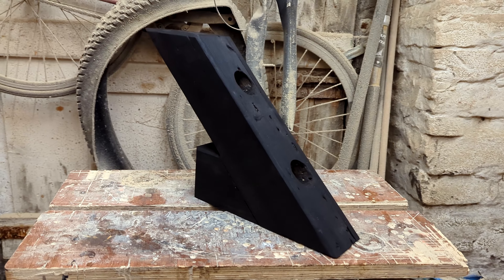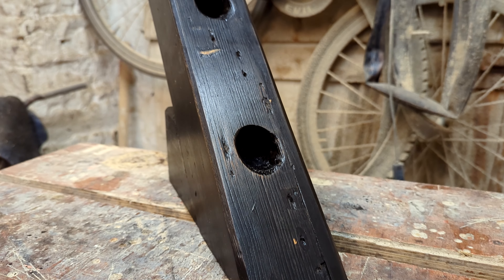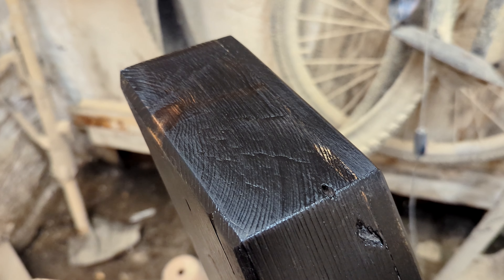I was filming this project before Christmas so I ran out of time and couldn't show you the staining process. I gave it four coats of that black stain. Once I'd finished it was this super flat black, so I gave it a coat of satin and just sanded it a little bit to give it a tiny bit of a shine. When I did give it a slight sand, some of the black did fade away a little bit, especially around the screw holes. Originally I chose the surface that had all the nails in because there was a metal stain around the holes, and I thought that was going to be cool. That little bit of sanding and the original nail holes made the piece end up looking rugged — it looks like it's ancient and almost burnt in some areas. It definitely didn't turn out how I expected, but it was still cool. Whilst making those two, I was coming up with all sorts of ideas of how to improve them, so there will definitely be another whiskey stand video in the future, because I need to build one for myself.